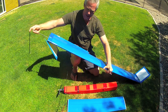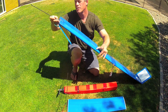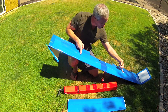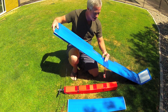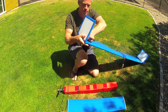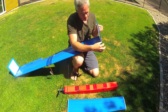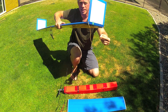The spar is another carbon arrow shaft which fits inside it with a small pusher section. The wing is just straightened, the main spar is pushed into place, and then the pusher is used to seat the main spar in its center position — so it's doubled in its central 30-inch section, making for a fairly rigid wing. Then the vertical stabilizers are deployed the same way with Velcro. Note the Dragonlink receiver antenna is at the leading edge of the vertical stabilizer and the ground plane lead just trails behind.